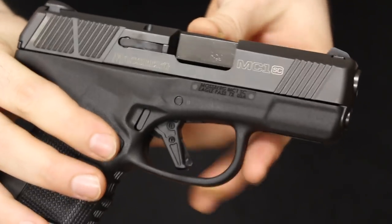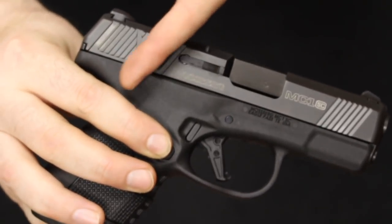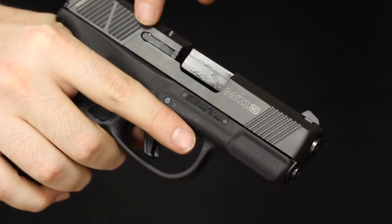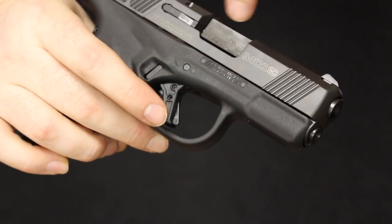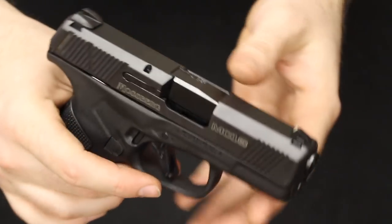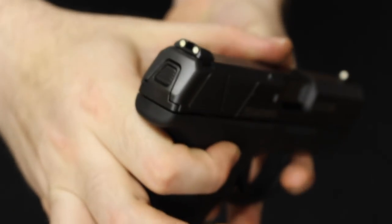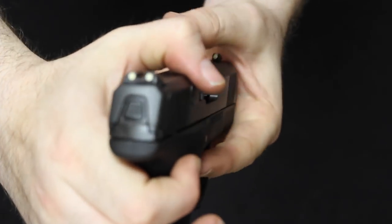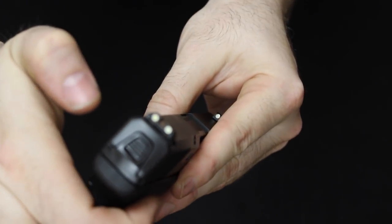Let's look at the slides, starting with the Mossberg. It has a stainless steel machined slide with nicely angled textured slide serrations in the back as well as up front for press checking. There is an external extractor. Up at the top, there is no chamber indicator, but there is a little ridge you can feel tactilely if the chamber is loaded — no visual indicator though. Up top you also have your sights in a three-dot configuration, dovetailed on both front and back, fully windage adjustable but not elevation adjustable, and the sights themselves are polymer in construction.